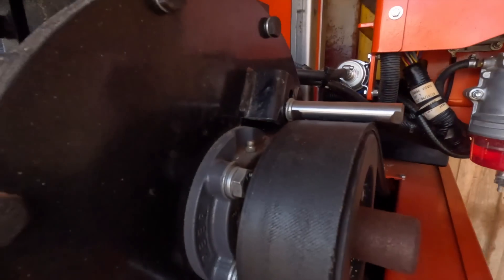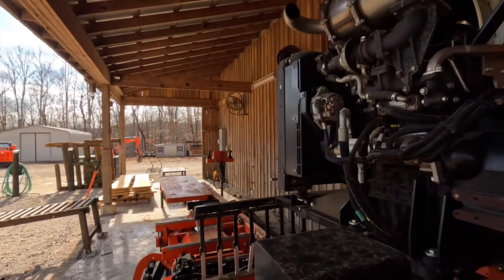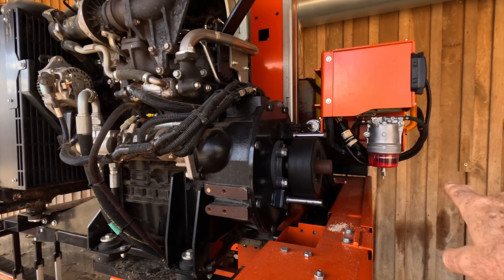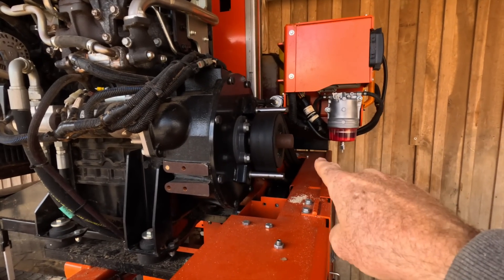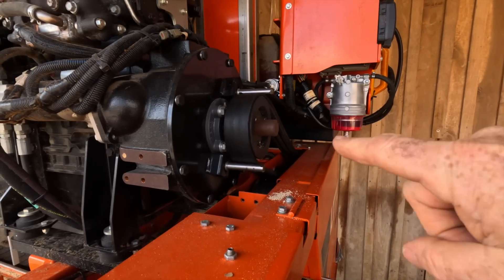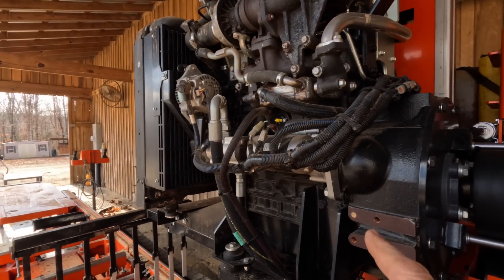This is very important because your drive shaft on your motor is cantilevered out. There, to there, to there. Typically this is the part that's hooked up to the transmission and it's going to have a support bearing. On a lot of sawmills, this drive shaft is not supported. So if you over-tension your drive belt right there, you're putting a huge cantilever load on your drive shaft that's being picked up by your sawmill engine bearings.